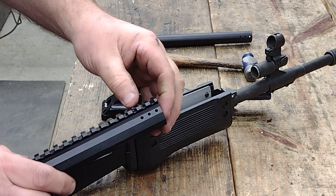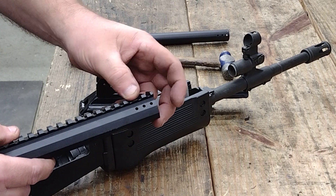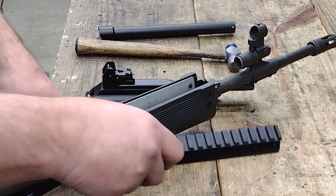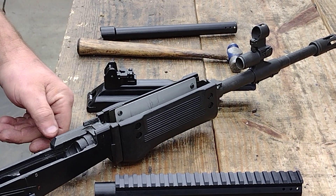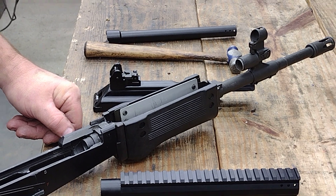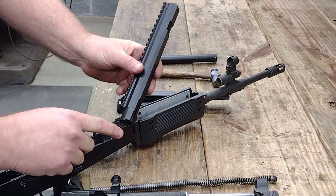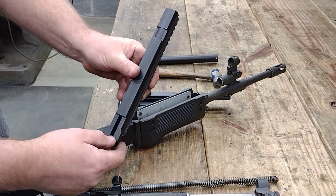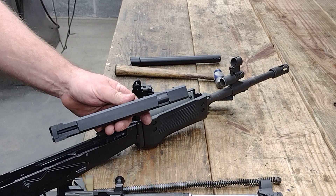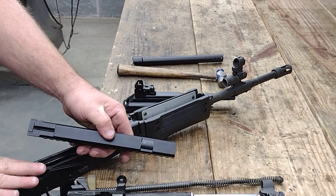Please don't hit these with a punch — they are mil spec hardened and they will fracture, burr up, and look terrible. There's the solution for you guys wanting to put an EOTech or an optic at the front. I hope everybody has an easy install — that's how you fit these. Do not grind on the ears that go into the receiver, and do not grind on that flat because it goes into this pocket and stops it from over-travel.